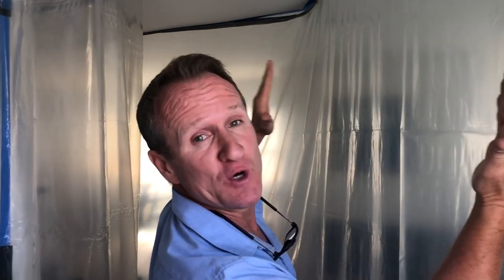Folks, all of that soil has to be bagged and removed. In order to do that, because the crawl space is inside the home, what we're going to do is — as you can see — we've built a tunnel, a plastic sealed tunnel right to the crawl space area. That's just because we don't want any type of dust, particulates, or mold to get into the home. So you might want to consider doing this if you are removing soil and the crawl space is inside.